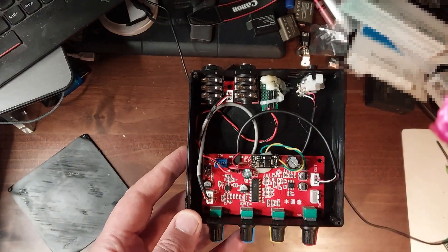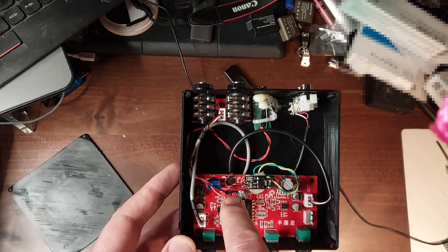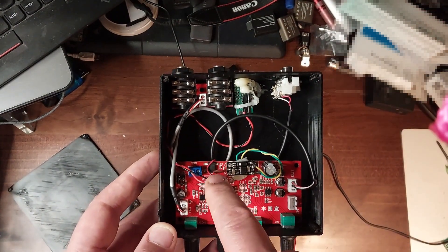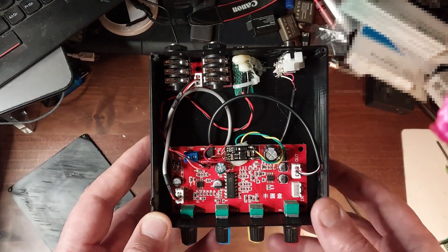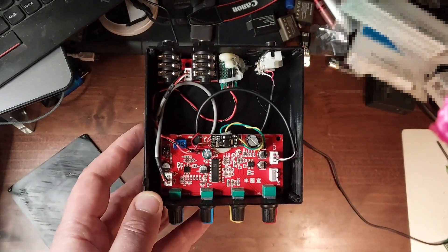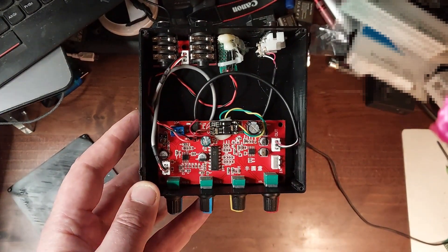This actually came with a very old-school power supply circuit: a bridge rectifier, a big capacitor, a 12-volt linear regulator, which in turn fed a 5-volt linear regulator. I'm feeding the whole thing with 5 volts, so I took out the two linear regulators, fed the 5 volts directly to the board, and used a little boost converter to make 5 volts into 12 volts for the rest of it. This isn't the nicest solution from an audio perspective — there's potentially noise on USB — but when powered from a USB charger rather than from a computer, it's not actually noticeable. This is not a high-quality device, and this little boost module seems to work quite well.